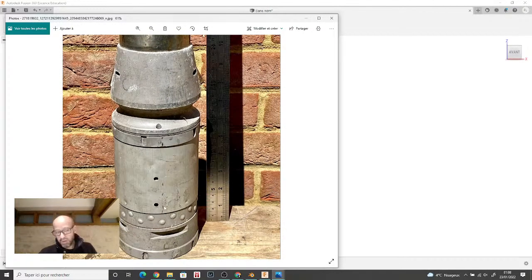on the part you're modeling, try to keep in mind what is being reproduced regularly as an array. Parts have been designed by people using this kind of software, the same mindset as you are currently using, and try to see where you can put some arrays. Let's say, for example, this notch. I don't know how you see it, guys, but I see a projected cut. We need some other picks, but 1, 2, maybe 3 and 4. We have room for 4 of these cuts.